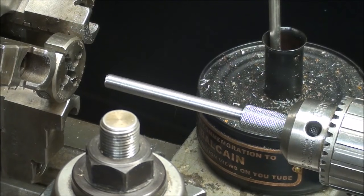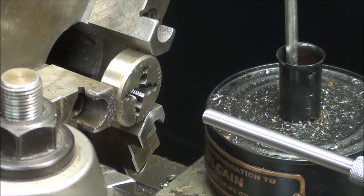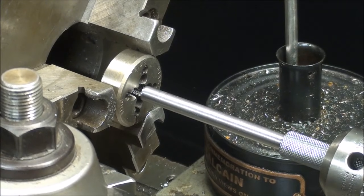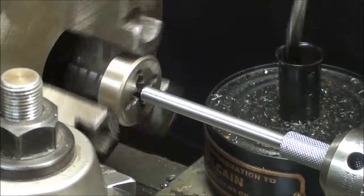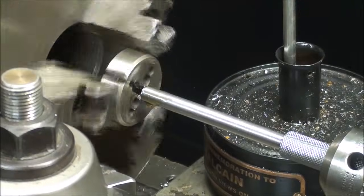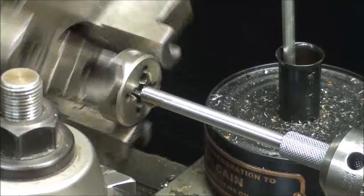All right, I'll put the machine in back gears here and I'll be ready to go in a minute. The tailstock must be free to slide easily, unlocked, and I've got oil on the ways. Don't ram the die with that. And I'm ready to go. I'm going to use plenty of oil. Now push the tailstock in and apply pressure until it starts.